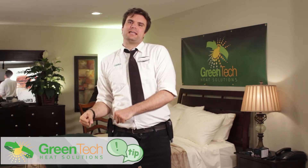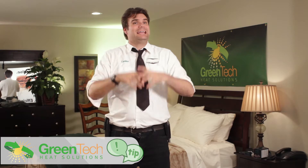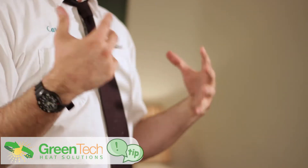Also, sometimes if you need to go up into a second story — as I'll be able to show you here — it's a good idea whenever possible not to just have a big right angle in the ducting, but if you can, try and lift up the propane heater slightly. Lift up that Titan so you just slowly take off maybe 15 or 20 degrees from that bend. It seems like a small thing, but that little additional angle will actually help get an extra two or three degrees of efficiency out of your Titan system.